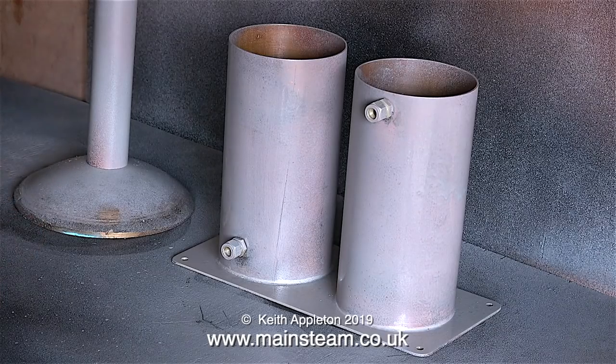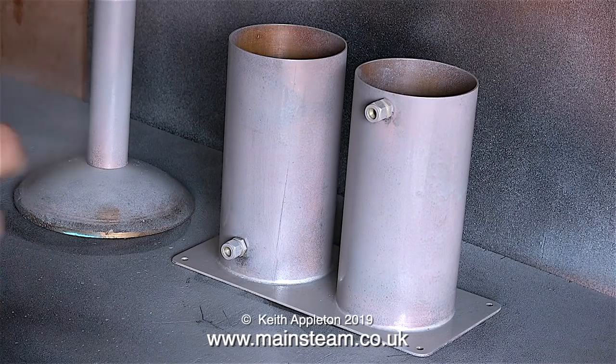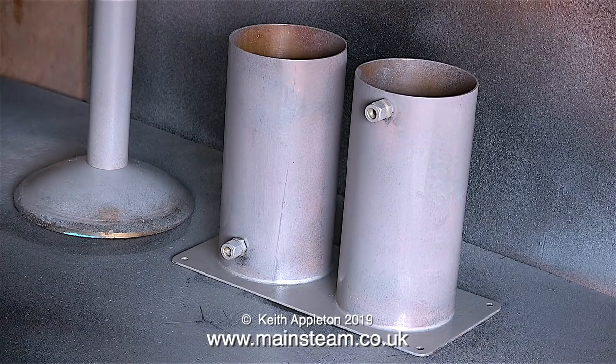I've polished up the brass ring on my polishing spindle, but the polishing spindle has also polished up parts of the copper and I don't want it polished — it needs to be keyed for the paint, so I'm using Scotch-Brite again. I'm now spraying the parts using Precision Paints etch primer. I really do like this stuff and best of all it works. You must be able to see the metal through the paint — this means the etch primer gets plenty of oxygen to do its job. The instruction leaflet says to wait 24 hours before overcoating, so I'm waiting 24 hours.